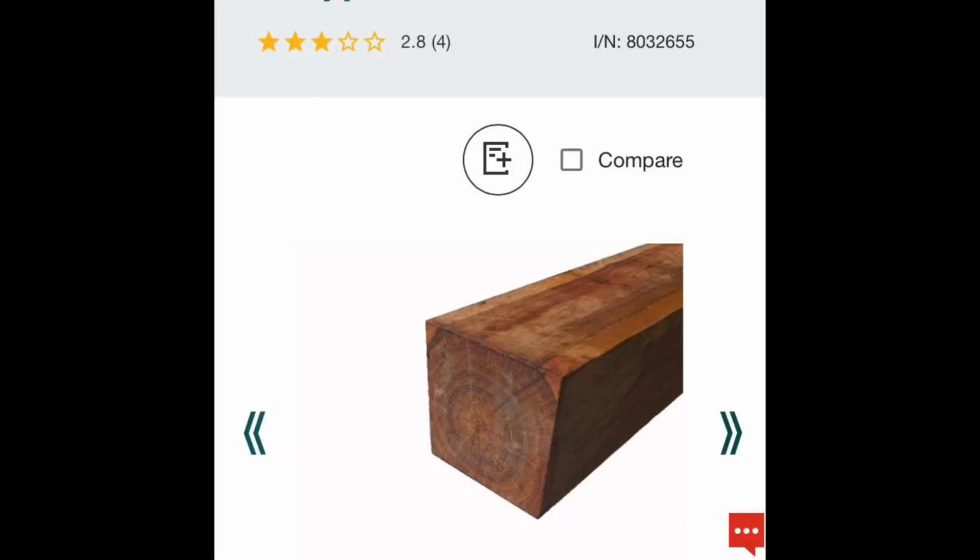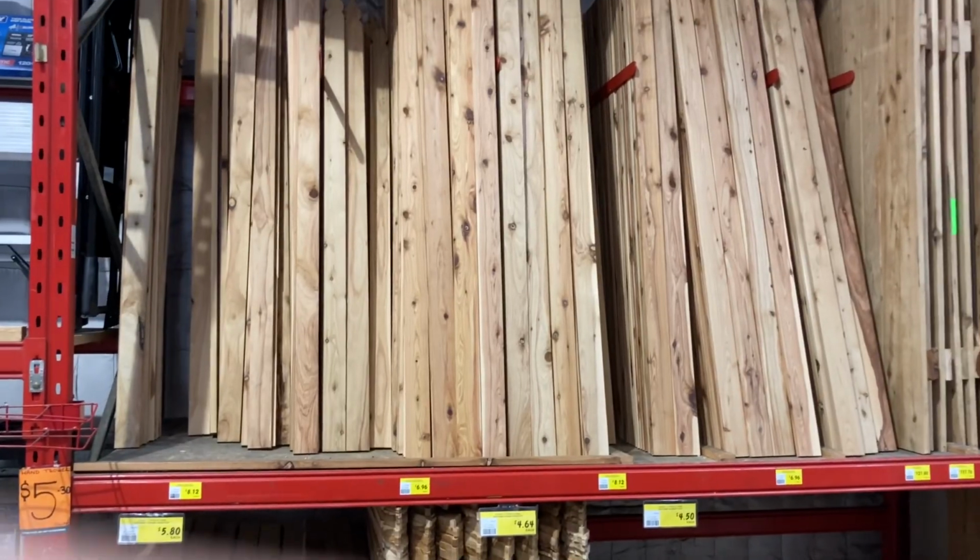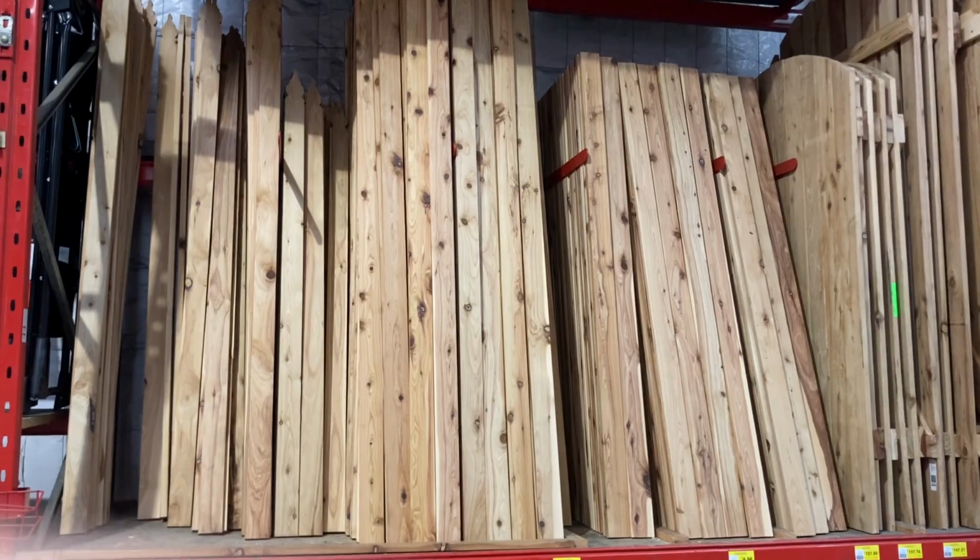Cypress is an oily timber, and this is probably why it's so popular for outdoor uses. Oily timbers can sometimes pose problems for gluing. Not that I've ever heard of any joint failures. But then again, my experience isn't all that broad with this timber. You can get native cypress at most hardware stores. Mostly it comes in the form of square blocks for posts and that sort of stuff, or in the form of fence palings. I've certainly had no trouble finding any in Bunnings.